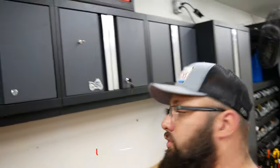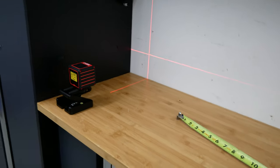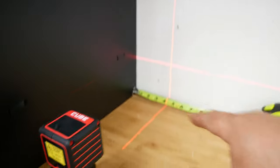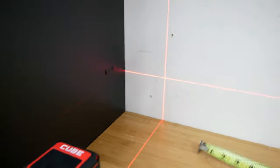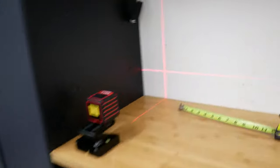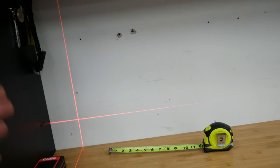Basically, this space is 23 inches tall and 72 inches wide. The backing is only 16 by 32. So what I'm going to do is 4 inches on the bottom, 3 inches on the top, and 4 inches on each side. I use this laser level on everything. I'm going to first measure 4 inches from the side — you can see that laser is right there on 4 inches — and then 4 inches from the bottom, right there on 4 inches. If you don't have a laser level, I highly recommend you get one — I'll leave a link below. Now, I'm going to mark there with a pencil line and figure out where the mounts go along this line.